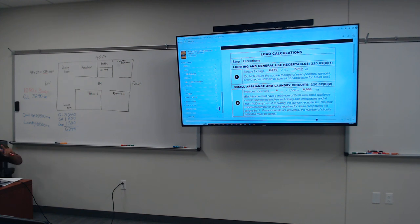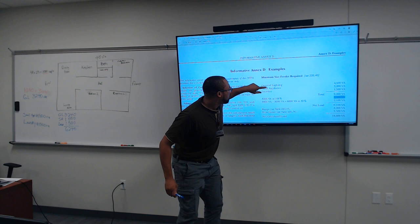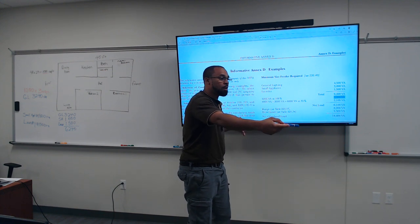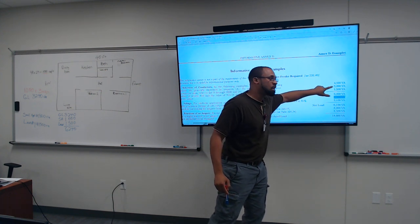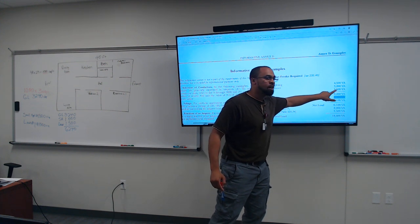So, with that being said, this goes back to small appliance and laundry. Remember in the NEC we read that it was 1,500? But it also states that you have to have at least two. So 2 times 1,500 is 3,000, and then we have the laundry, which is 1,500. Does that make sense of what it's saying in the NEC code book?